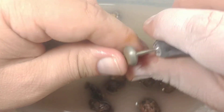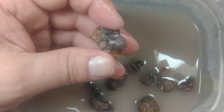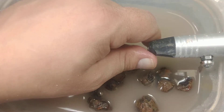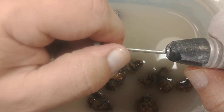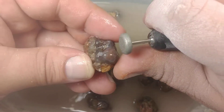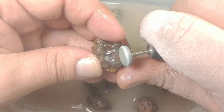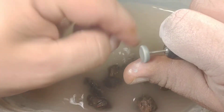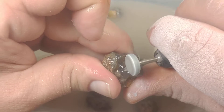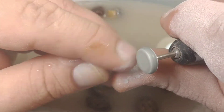So ideally this is as far as I'm going to go — I can start to see some color through that. At that point I'd switch out from the coarse to a medium. These quick change handles are great; they make things go much faster. Just to give you an idea of what I'm doing, I'm going to go a tiny bit deeper. This will make that chalcedony cap a little bit clearer and easier to see through. I'm right on top of a small bubble. That's as much as I would want to do with coarse — the rest of it I'd be using medium or fine.